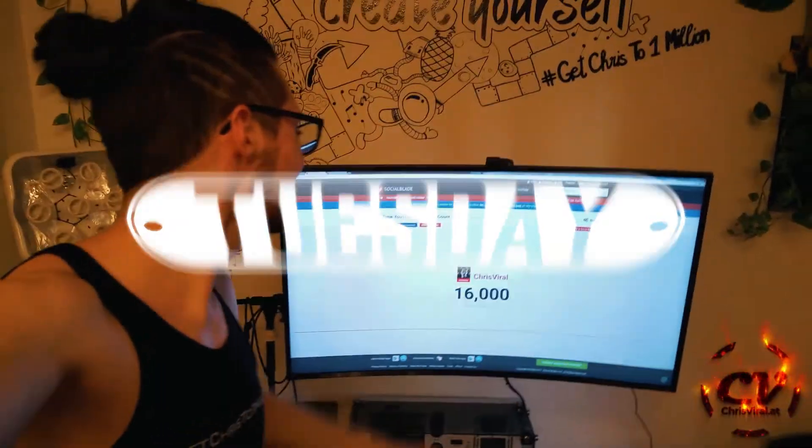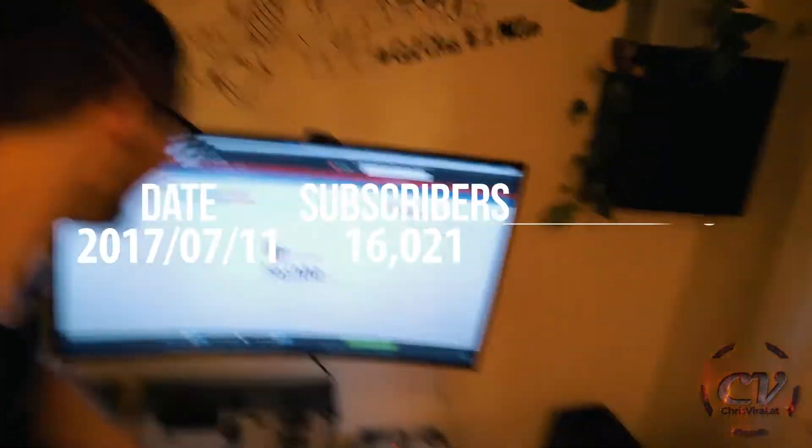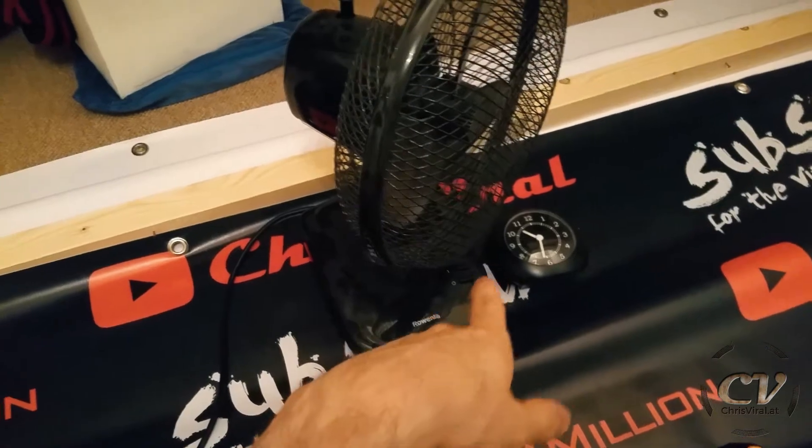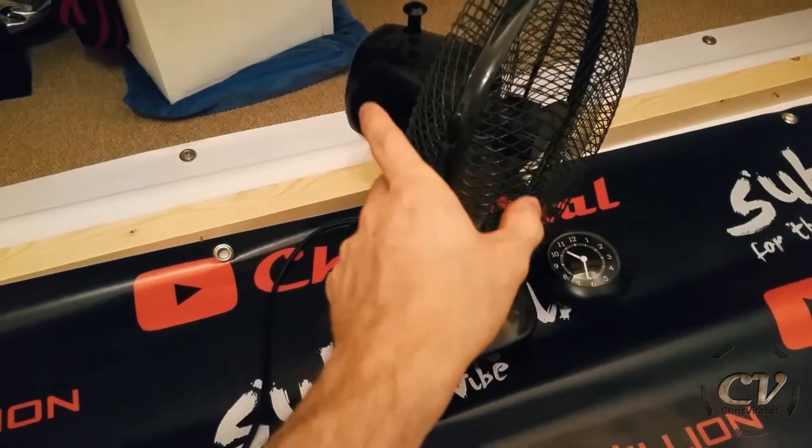It is Tuesday — check it out, 16K views! The topic for this vlog is another experiment. What I have here is my Halo Bolt, fully charged. The last indicator is broken. The Halo Bolt has a capacity of 58 watt-hours, meaning this little box is able to sustain a 58-watt load for one hour. Let's find out if that's true and how much conversion loss there is. I'm going to test it with this little fan on stage two, which uses 25 to 26 watts.